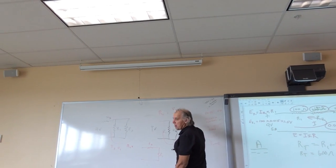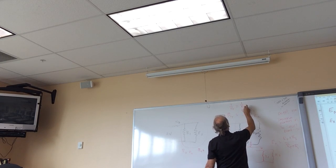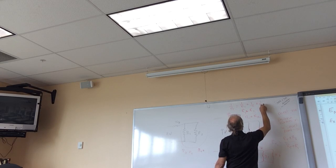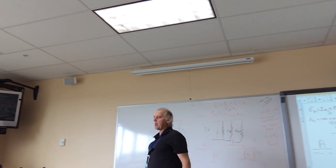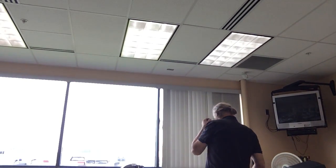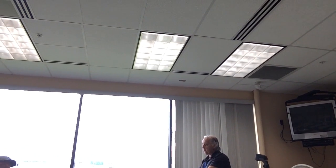The only other way to do it, Steve, is 1 over RT equals 1 over R1 plus 1 over R2 plus 1 over R3. Then you can do all of them at once. It doesn't matter. Whichever one you're comfortable with, I'm okay with. Just show your work so I know which one you did. And in the field, you'll be really tired and you'll only remember one. So you just have to do it on paper. Always take paper and pencil with you.